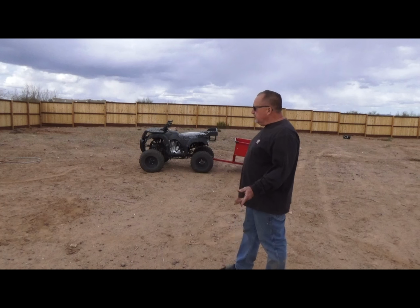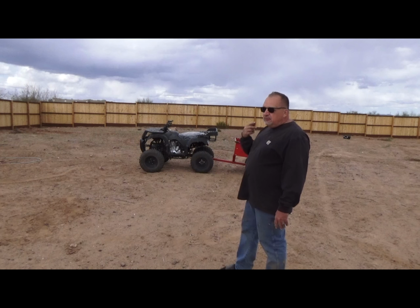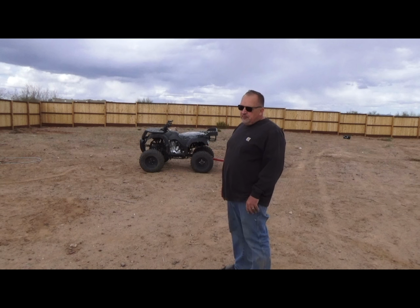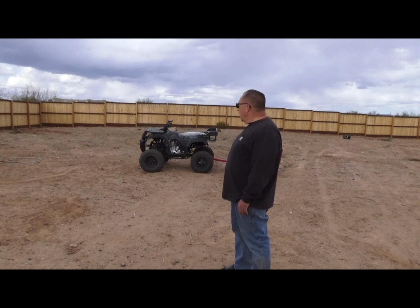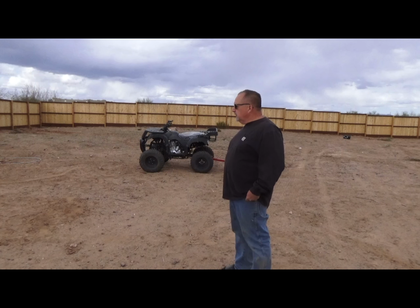So something I don't know if I mentioned before, but I bought on eBay a VM26 Mikuni clone, and we put it on there. But before I put it on there, I went to Jets R Us and I got a Pilot Jet. We changed it to 50, and I forget what was on there. And then the primary jet, we went to 115, and put them on there. And I gotta tell you, man, the power, whew, what a big difference from the old carburetor that was on there, the stock one.